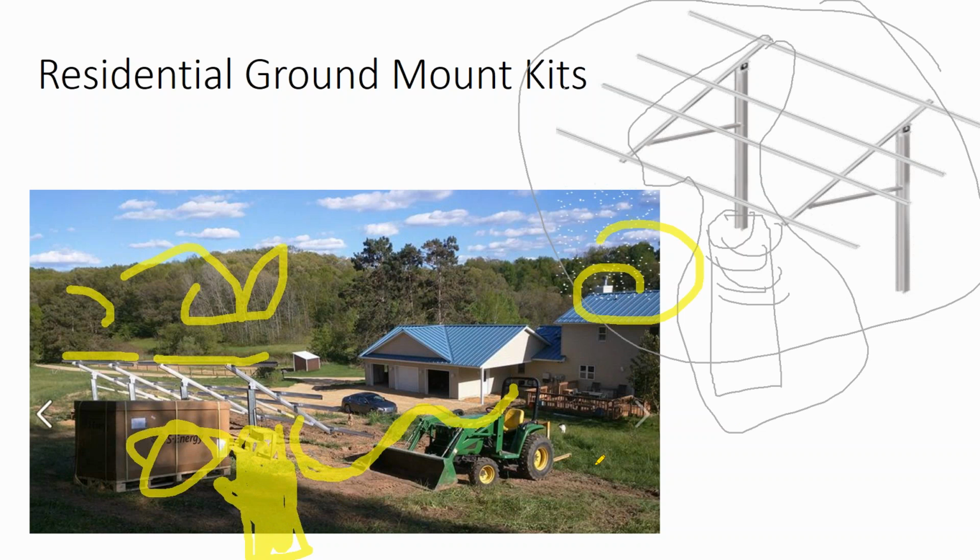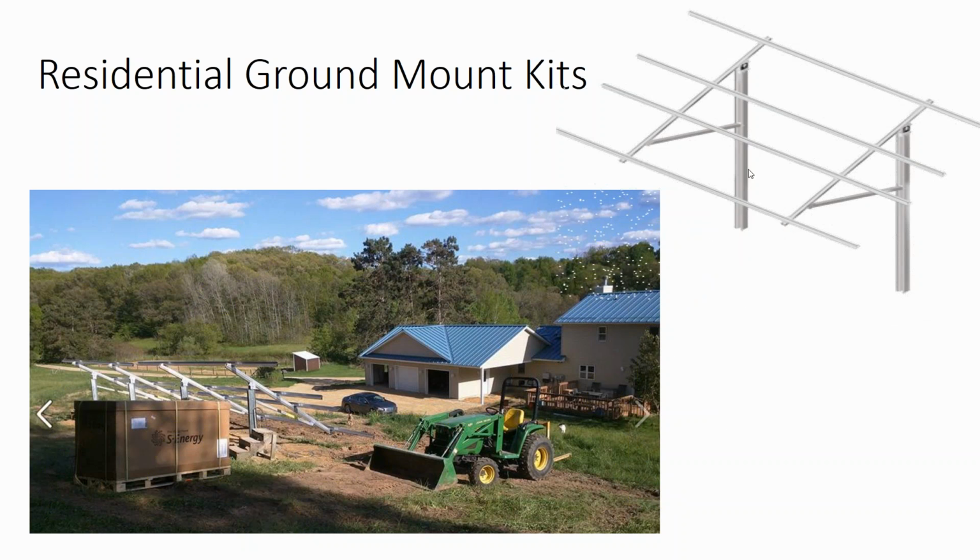And the nice thing is you're no longer on the rooftop. It's much quicker to install on the ground than it is up on the roof. It's much safer to install on the ground than it is up on the roof. The maintenance is there. I mean, there are great reasons to go on the roof too, but the thing that I have found is that general contractors, when they do a ground mount, even if they have to dig a 20-foot trench, are going to want to rent a trencher because they know that the trencher is going to offer a better value than paying their labor to dig it out. So if you're handy with construction equipment, your ground mount pricing can be quite competitive. I would price a ground mount to be the same as a residential mount simply because I don't like getting up on the roof. If they have the space to go on the ground, I'd rather keep the project much more simple by having it stay on the ground.